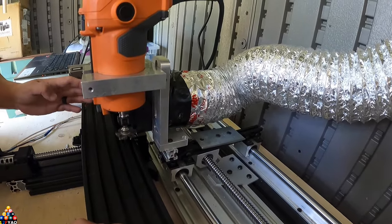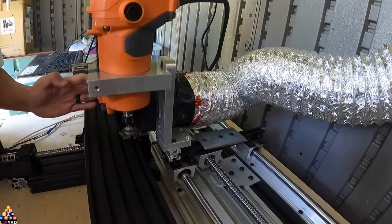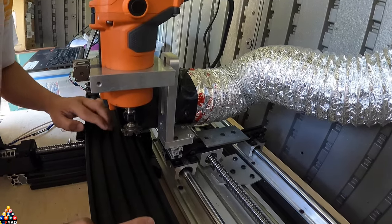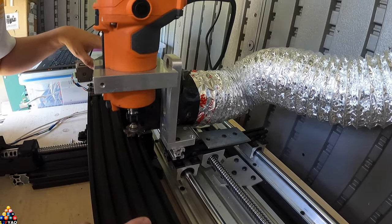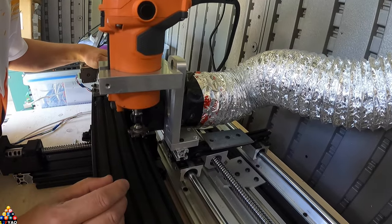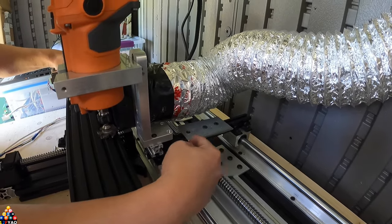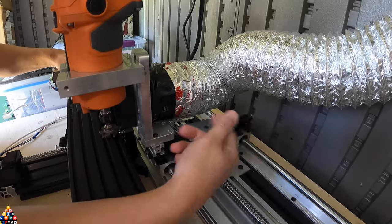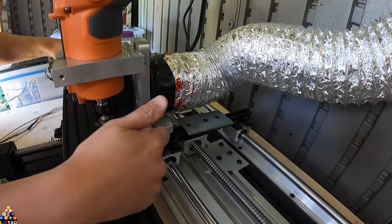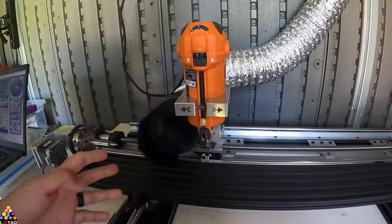A wood blank is about 18 inches and I don't want to move the tailstock to 18 inches and then back to 30 or 31 inches. That's one of the reasons I want to order another fourth-axis head stock so I can do that independently. I also added calipers here with a magnetic arm — it measures and tells me how many inches it moves.